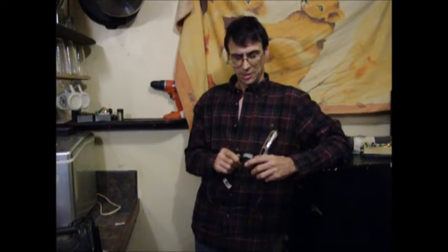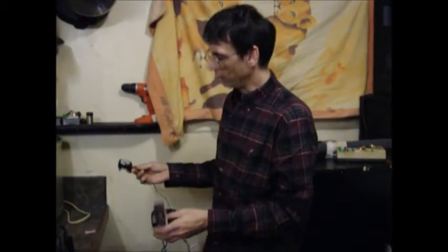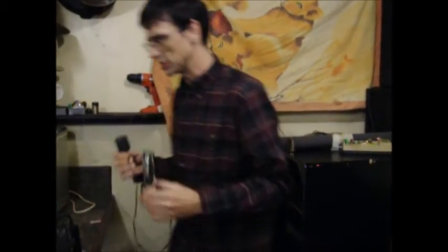If I've got a 110-volt appliance like a 3/8 drill — it draws 3.5 amps at 120 volts — at 12 volts, just move the decimal over because 120 and 12, you just take the zero off. That turns into a 35-amp draw. A 3.5-amp appliance at 120 volts is knocking you down 35 amps at the DC end. It doesn't take long before you've got a lot of these things adding up.